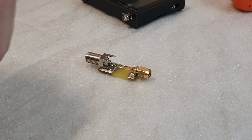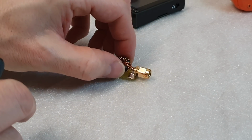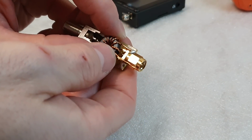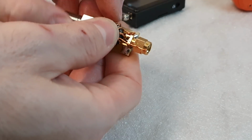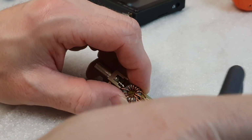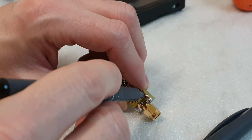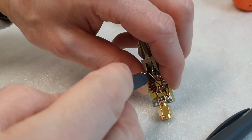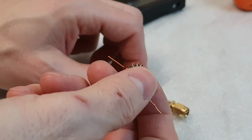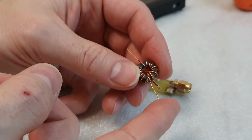So before grinding the ends of the wires, we should fit this little coil onto the PCB board, and we can mark the lengths of the wire we should grind, here and here. So now we should scratch the wire and remove the isolation from the enameled copper wire.